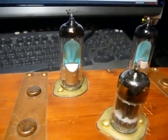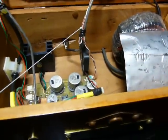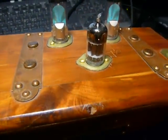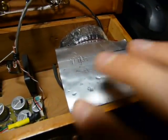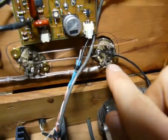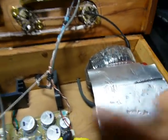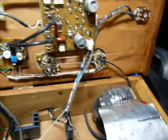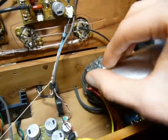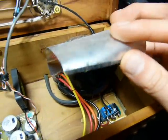And that's pretty much it for this entire thing. There's not much that goes into one of these, but it sure sounds great. And with this case I'm very happy with the final result. Underneath this shield — which is just some aluminum foil with packing tape on it — there's a small transformer. All that does is provide the high voltage supply for these two tubes, which needs about 120 volts to operate correctly. These tubes were kind of a secondary addition, so it's really a dual supply project. I could have made some voltage multipliers to get the correct voltage, but I had this transformer laying around and it wasn't doing anything.